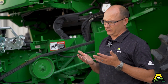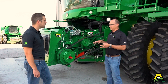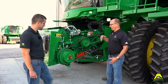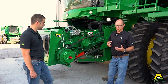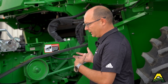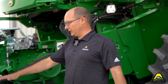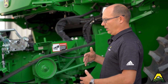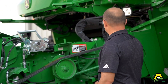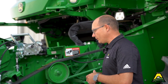At a standard stationary speed you should be running 510 to 520 feeder RPM. When this machine is slowed all the way down, the same option applies on your multi-speed five-speed feeder house - first gear is that 510 to 520 as well. Another option that this machine doesn't have is fixed speed. With fixed speed you're still running the same reverser we have on all our machines; it's just a V-belt that runs all the way to the back and stays at 510 to 520 all the time.